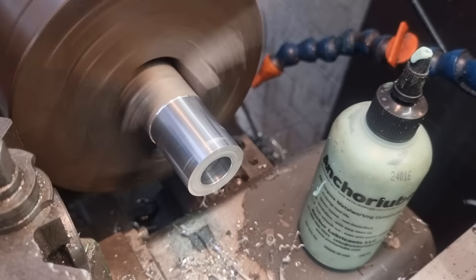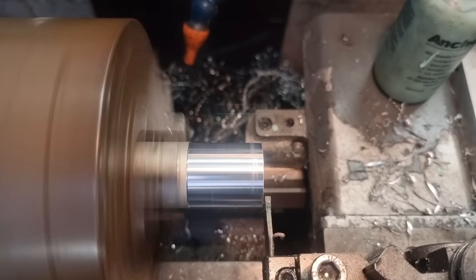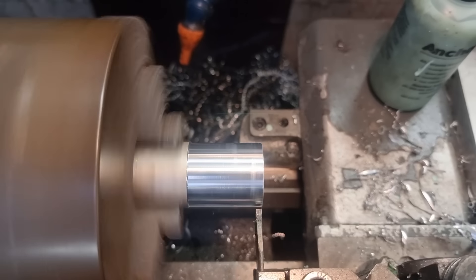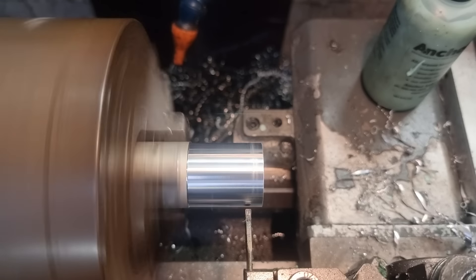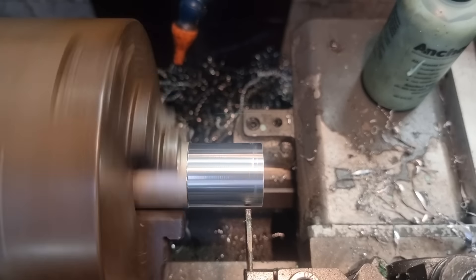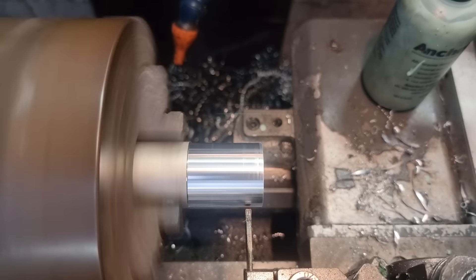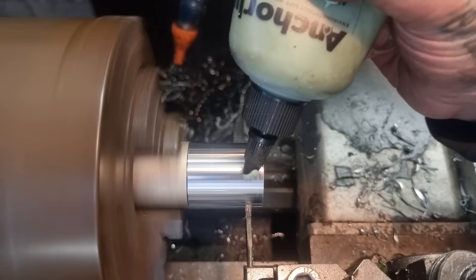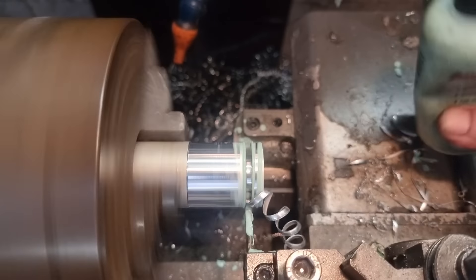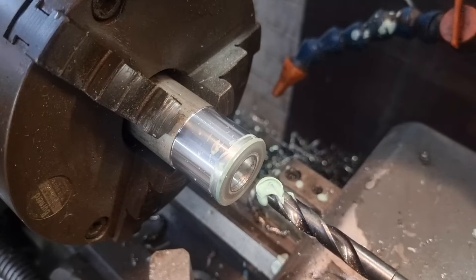Get the tool out of the way, break that edge, break that edge - now passing it on. Just touch on there and this first one wants to be 6mm, so we'll move it along 9mm. Too far - 9.25, we'll leave 0.25mm, a quarter of a mil, a tenth over. Lock off the saddle, and away she goes. That'll be the lube as we go. That's going to disappear - so that's one down, one to go.